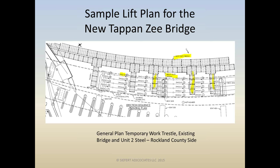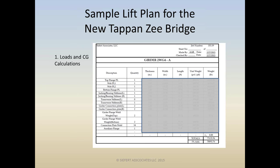Here's a drawing showing the general plan of the work trestle — a light-duty and a heavy-duty work trestle, with fingers for cranes to be positioned on for erection. There are five girder lines. The spans are rather large — close to 300 feet. Curved girders add complexity, multiple splices, and most all of these are picked with two cranes. Issue number one: here's a slightly masked view of girder 2WG4, with all its parts and pieces and total weight — a typical detailed takeoff with multiple lines compared to shop drawings, with 5% added to the weight.